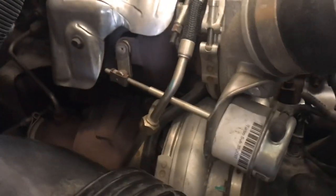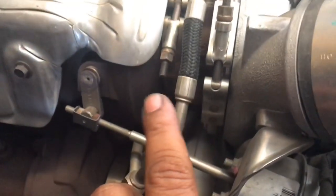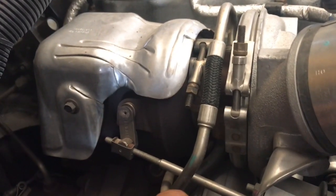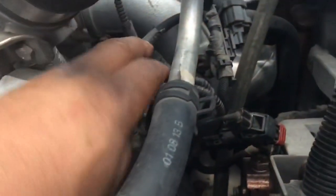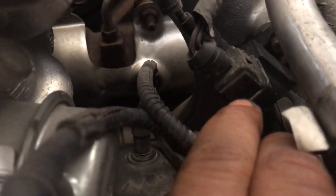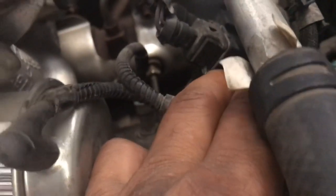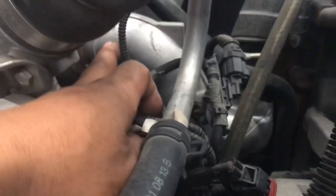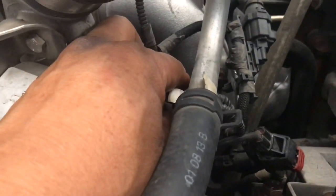Well guys, on these particular units, this is turbo 2. This here is turbo 1. When we get these codes, TC1 TOP sensor low, let me see if I can show you guys real quick. Right here, you see the issue with these, the sensor is not actually bad. We've been lucky to where we remove this little pipe that connects the top turbo to the bottom turbo, which the sensor is actually bolted onto.